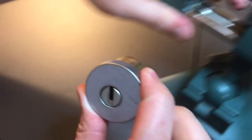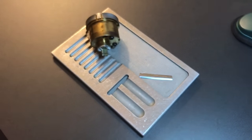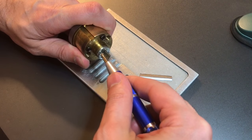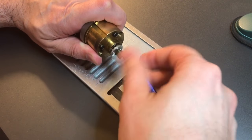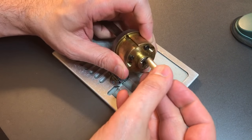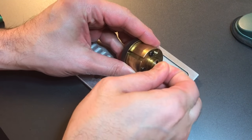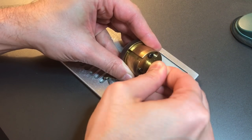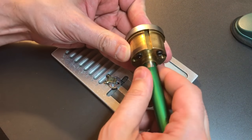Okay, let's take this guy apart and take a look at what's inside. We're going to have to be careful not to lock this up as we take it apart — it comes apart with two Phillips screws. Because this is an older cylinder that I'm not familiar with, I'm going to put a shim in here before I try to open it up, just to avoid any problems. If I can get that shim in — it's pretty tight here.